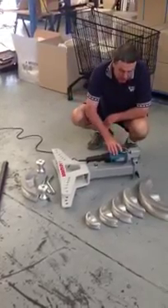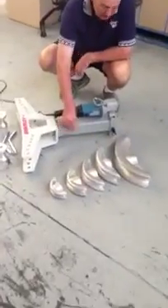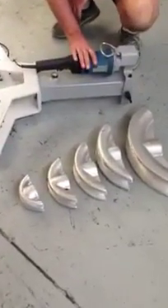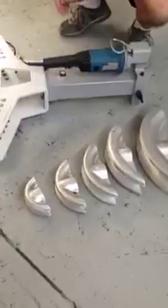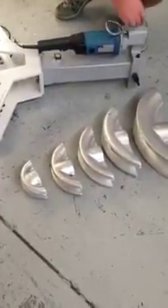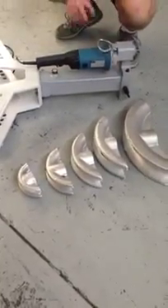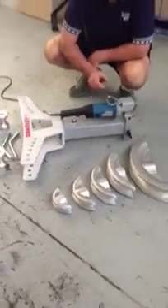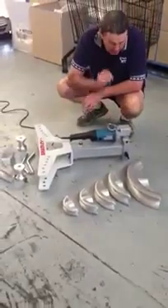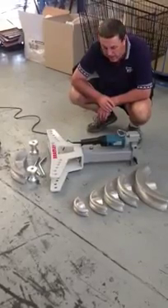The principle behind this is a standard hydraulic unit that we make. Up the top is like a sausage type motor, not required to be huge, because the principle is that it pumps a little bit of oil a lot of times. In other words, at the optimum revolutions, it pumps a little bit each time, giving you the effort behind the bend.